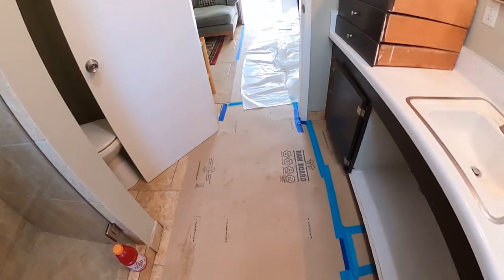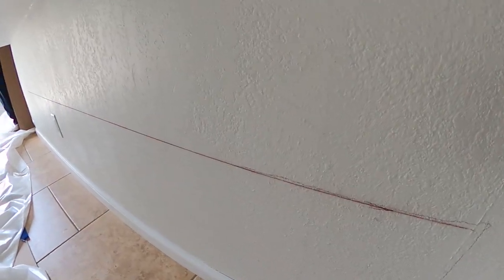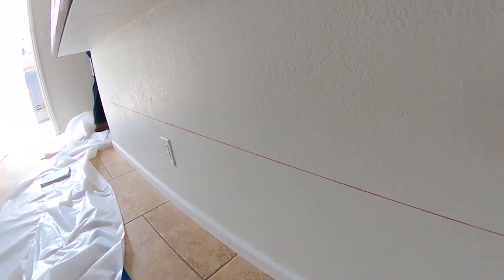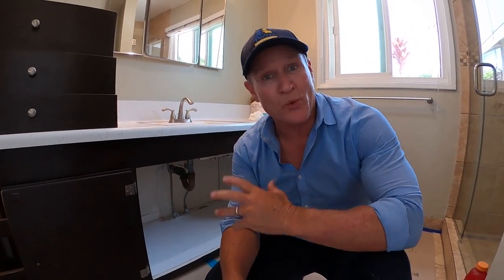So what we're going to do is try to cut — there's some plywood there in this wood — we're going to cut all this out and sanitize all of this wood as well. We're getting all the floors completely prepped with our containment. We've chopped out our line for a straight cut. The owner decides she wants to try to keep this vanity, so we're going to go underneath and cut underneath this sink here to save this vanity and still do the proper job.